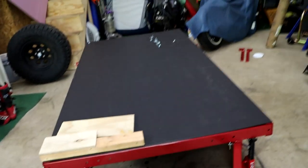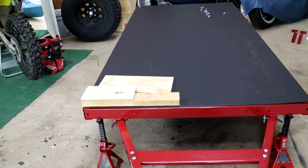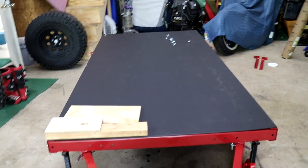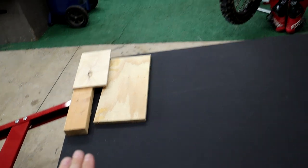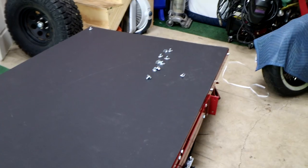So in this video I just want to try to get the floor done and maybe the walls cut, but I don't have high hopes. The floor — I'm just going to frame it out with some 2x4s, drill the holes, bolt it down. I'm going to liquid nail this polyethylene to the 2x4 frame, then I have a piece of half-inch plywood that will go on top of that with the insulation in it, but I think I'll put that in later. Let's get started.